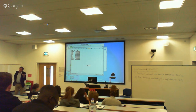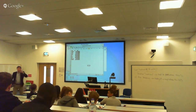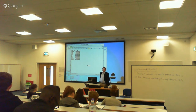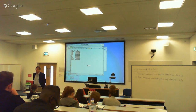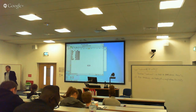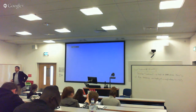Then we have other alloys, like nickel alloys. What's special about nickel? Extremely good corrosion resistance. What's bad about it? Well, not bad, but it's expensive. It's about £7,000 a ton, £7 a kilo, over $13 per kilo. That's expensive. Then the other alloys, depending on what they have, are generally expensive.